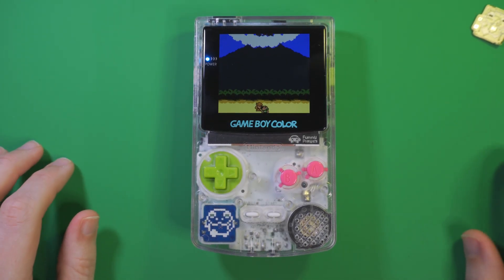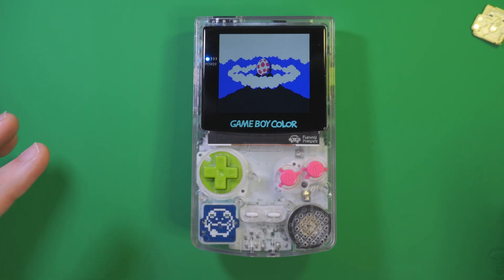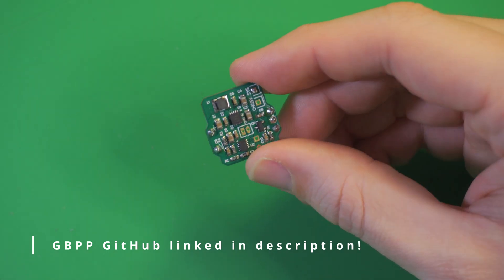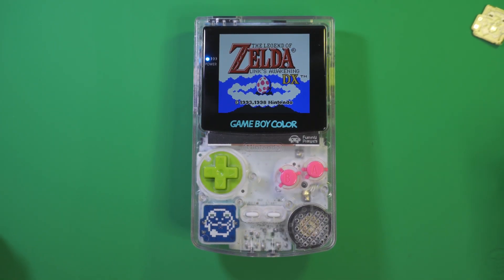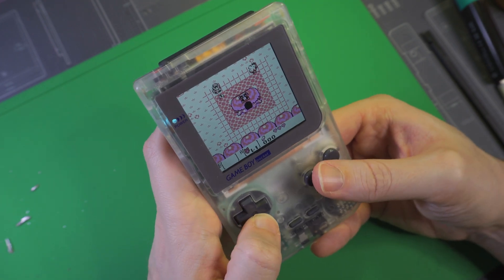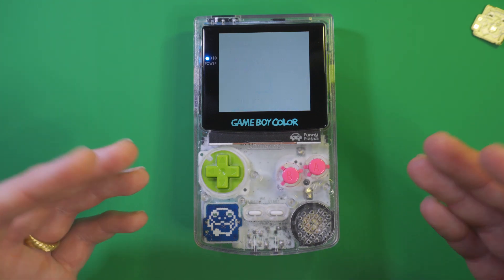Now is a great time to segue to competitors, and there are several of them — some not worth discussing yet, and some which are, like the Game Boy Pocket Power by Marshall H. The GBPP, as it's often known, is based on the same voltage regulation IC used in the frogulator, so in theory you get similar efficiency. Additionally, it contains a LiPo charging circuit, so if that's your jam, it's an excellent alternative to the frogulator. To do the same with the frogulator, you'd need to add a separate battery charging circuit. But it's often about trade-offs, and unlike the frogulator, the GBPP doesn't include a battery indicator. So it's really up to you which feature set has more value — make the best decision for yourself.